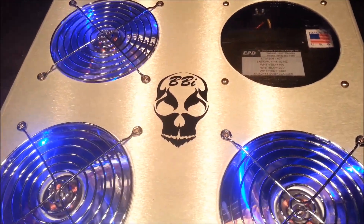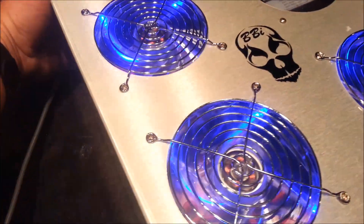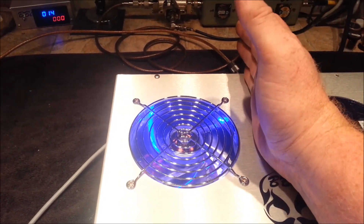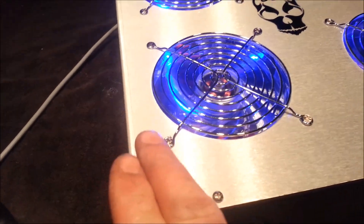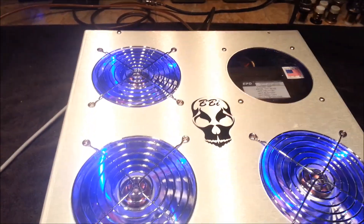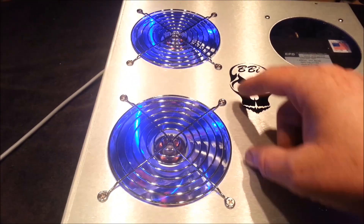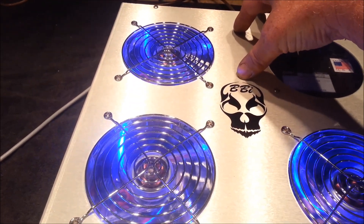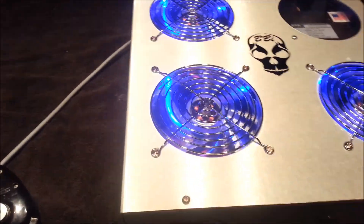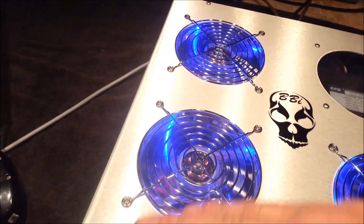Okay, so I slapped the tin on it — one, because I wanted to show everybody how pretty it was, and two, I wanted everything to get some air moving across it. This box utilizes my closed-loop system. That's where I block off the back of the heat sink, because there's about a gap that goes from the end of the heat sink to the end of the cabinet. So I block that off, and up here in the front corner, where the other end of the heat sink's at, I block this channel off, so all this air that's getting crammed through this cabinet right now has only got one choice — comes down across the components, cools off the components, and then goes out the heat sink, straight out. I don't put my bridge rectifiers back here in the corner of the cabinet where they can't get any airflow. I actually line them up in front of the heat sink, so they're forced-air cooled. Every component that builds heat inside this box has got a heat sink attached to it and is forced-air cooled.